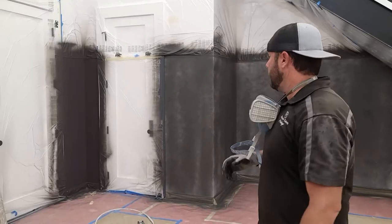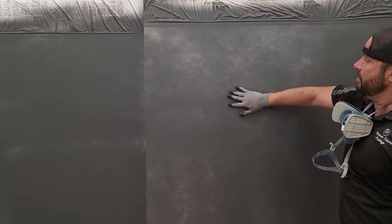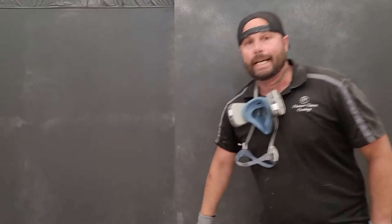Okay. So here we are, you can see our sticky coat is all done. It's been probably 20, 30 minutes or so. It's all nice and dry. You can see where all our hot mud patches were. And so here we go, we got our color in here. We still got our line holding tight. And now we're gonna do our real coat. Just kind of like our prep coat, that's kind of to tell us where all the patches were, seal everything up. And yeah, look at that. That's our finished corner. And we're gonna get to it. Jose's gonna guide you through this.